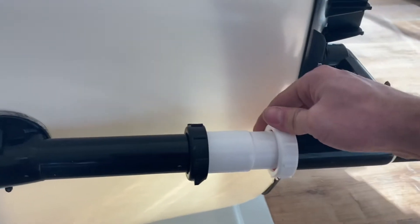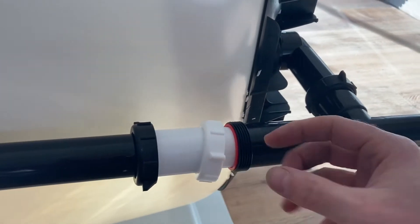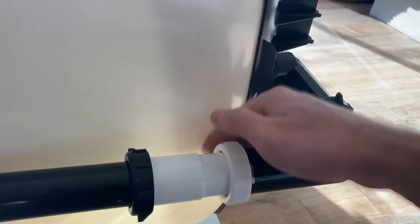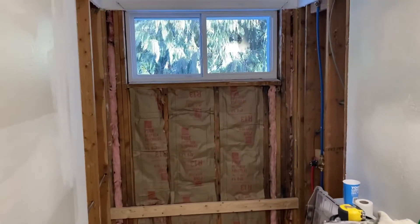These are just little nuts, and there's a washer with an acorn shape on one side that goes in here. You tighten it down and it compresses the rubber gasket, making a watertight seal. Now that we've got this assembled, we can fit it into our bathroom, which brings us to the next step.